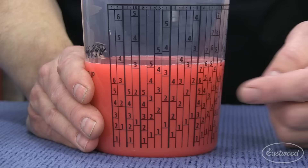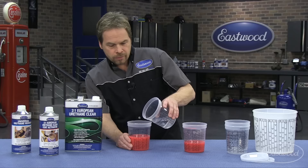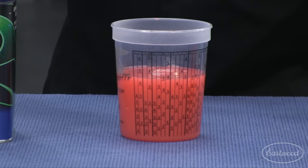There are more columns here — a half part and another full part. So if you have more than two components, like two-to-one-to-one-half, we'll go up to the next five with an additional reducer. Just pour up to the next five and again we've got a precise mix ratio.